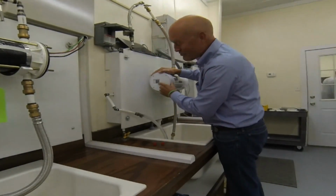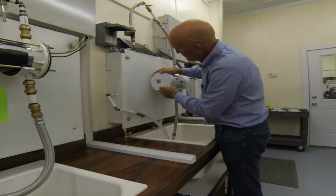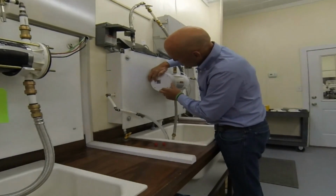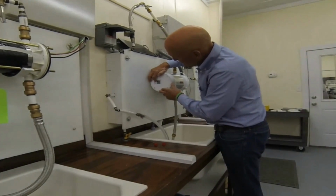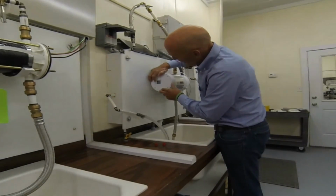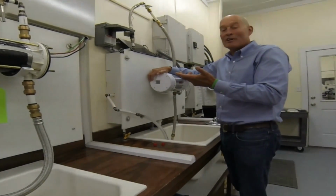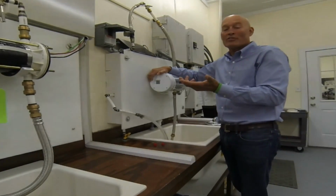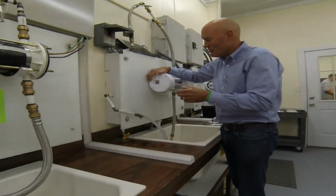And what you'll see is the number 15 flashing, which is the current setting at this point. Then you'll just push the up button to go to 20 amps, 25 amps, 30, 35, 40, 45, or 48 amps. And you can go up and down as much as you want. And by the way, you can do this anytime during the life of the unit. So if you decide you want more power later on, if you have it set at 30 amps and you want more hot water, you can set it at 48, so it isn't just a one-time shot.